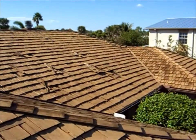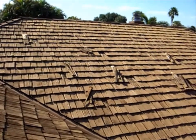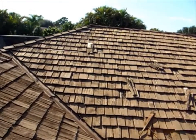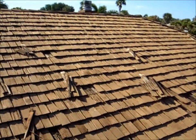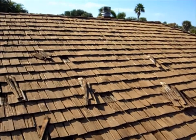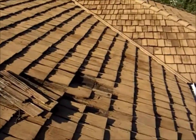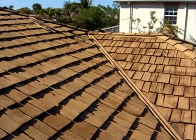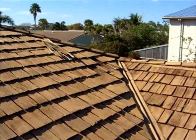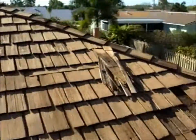On the front side of the roof you can see we have more shakes out. I do the roof in two passes — first I get out the really bad ones and put the wood in, then go back around and get the not-so-bad ones. That way you're going to find that you spread the wood evenly over the roof.